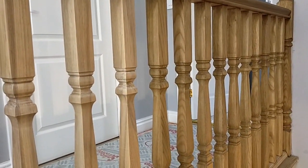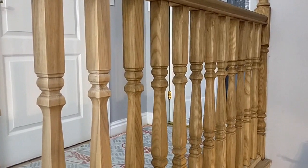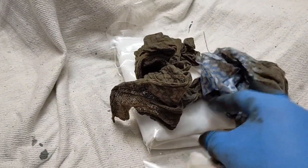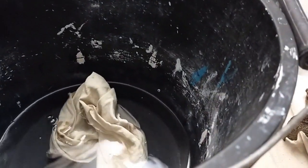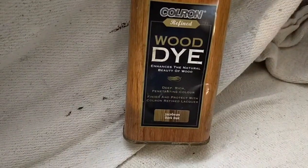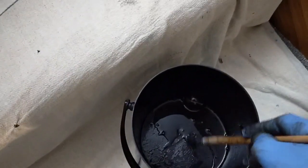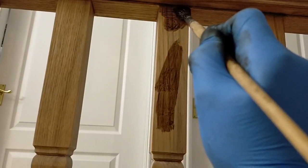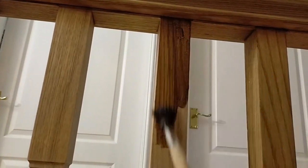That one's not been done, neither of these. I've got some lint-free cloths, but I do find these blue cloths a lot better. I'm only applying the dye, so I've got a lint-free cloth wet — that's in the bucket of water — that's just if I need to take off any excess dye. I've got some dye in a pot. Really you should put it on your cloth, but I'm doing spindles. The handrail's already been done, so I'm just working up that edge with the dye.